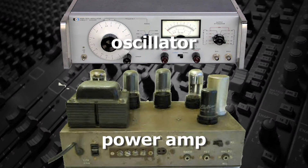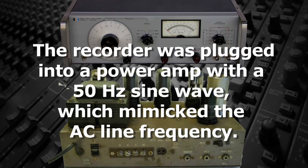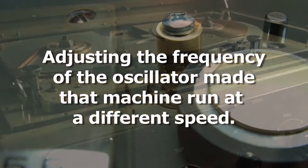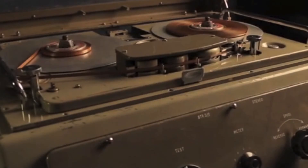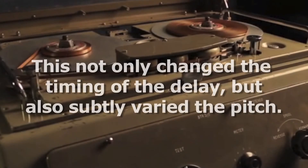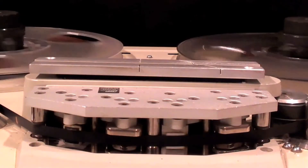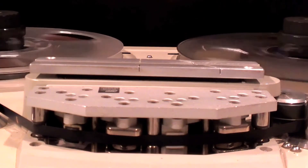This delay could be adjusted by using an oscillator that fed a power amp used to supply AC power to the second machine. The oscillator mimicked the 50 Hz line frequency, and by adjusting the frequency of the oscillator, he was able to speed up or slow down that machine's capstan. By slowly changing the tape speed of the second recorder, he could not only change the timing of the delay, but could also subtly modulate the pitch. Combining this with the natural speed changes due to the wow and flutter of the two machines enhanced the chorus effect.